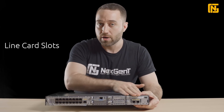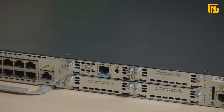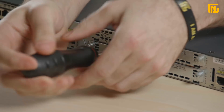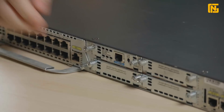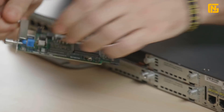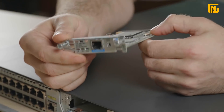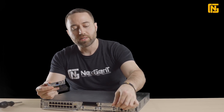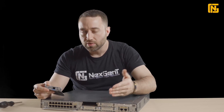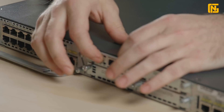We also have our line card slots here in the back. We can unscrew one of these — the purpose of these line cards is so that we can change the type of interface connecting out to the WAN or any type of connection in our network. In this case we have a T1 line card. So wherever this router was used, it must have been connecting over a T1 circuit — this is a T1 DSU-CSU, old school T1 card. If we were connecting to something else, like fast ethernet, we could pop a fast ethernet card in here. We could also pop a voice card in. These expansion slots let us configure and add any type of connectivity we want. That's what's so great about enterprise-grade routers.